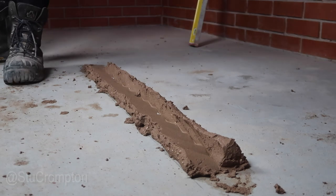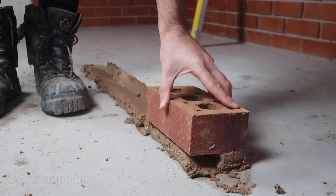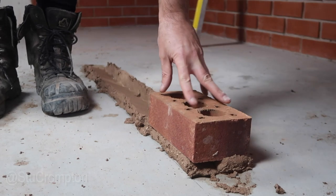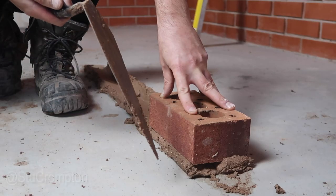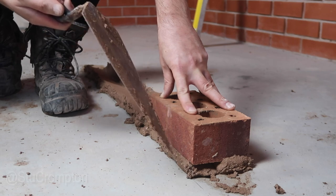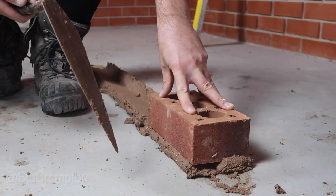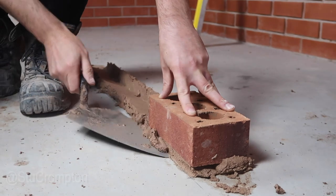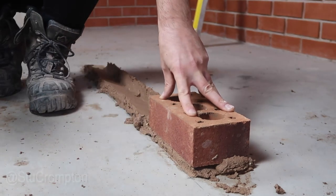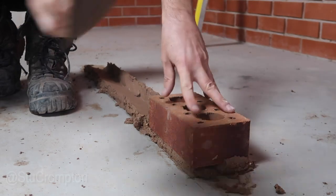I'm going to lay backwards and we're checking our brick — that's good, so we can lay our first brick. When we're pushing our first brick down, press with our fingers or our palm. Flip your trowel and keep your eye on that line because we're laying to that line as well. A couple of wiggles, and we're looking for a 10mil bed. If you do need to tap it down, use the bottom of your trowel — but whatever you tap there, tap over here just to even it out.